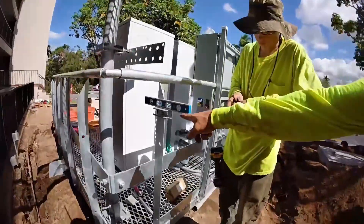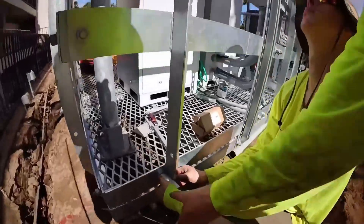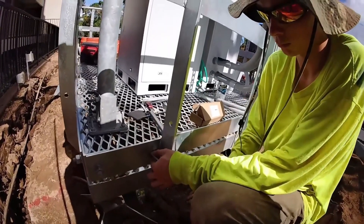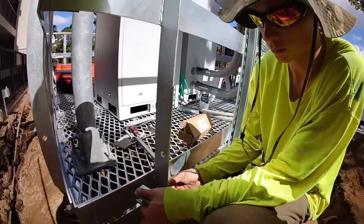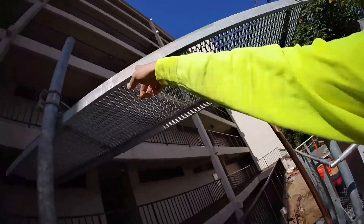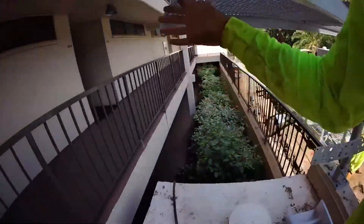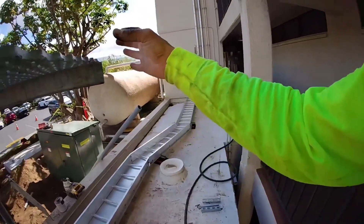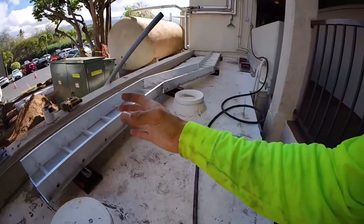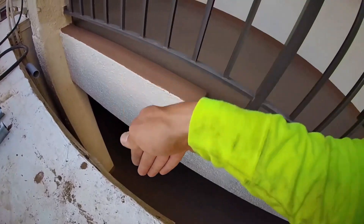We've got our new plan — sweep up onto this strut. I would have done it the other way with the strut on this side, but let's try it. If the sweep works — do you think a 90-degree sweep is going to fit there like that? Versus maybe taking that one and putting it up on this, as long as the sweep doesn't hit there. Up the strut, across here where they're going to be running their cables as well. We're going to come over here, and this is where things get wild — we'll probably put an LB here because at that point we'll be at three and a half bends, nearing 360 degrees. Stick an LB right here, have it come down, 90-degree bend onto some dura blocks with strut strapped onto that dura block, and then probably another LB right here — either at an angle or with enough room to do another 90-degree bend and then connect to our conduit.